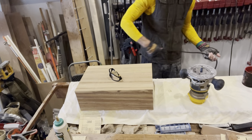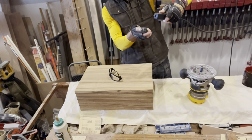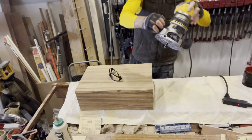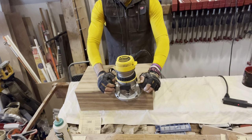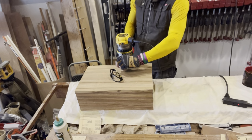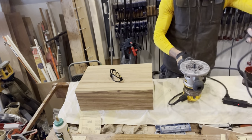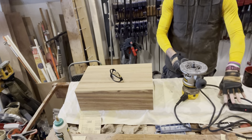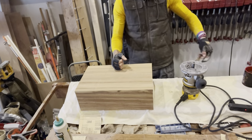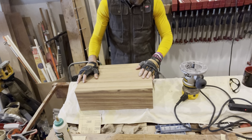Now, one thing that's important when we're going to freehand route, I have my drop cord from my ceiling pulled to just the right area. All right, I'm gonna go ahead and plug her in, but that gives my cord room on the bench, because as we move through this piece, we're actually gonna need that cord as we come around. We're gonna want that cord to stay the hell out of our way. So you don't want too much cord. That's why some of it's left down here. But in case I need it, it's right there. The plug-in's just right here. It's the safest place to work. If I have a large project, I'll actually just set something on the floor, use my feet as the hold down for it. In this case, I'm using a towel. It's gonna serve its purpose. We're gonna take it nice and slow with this.